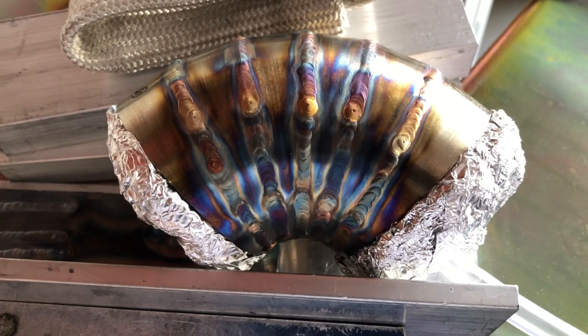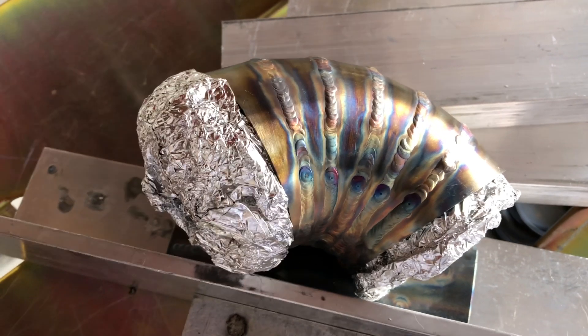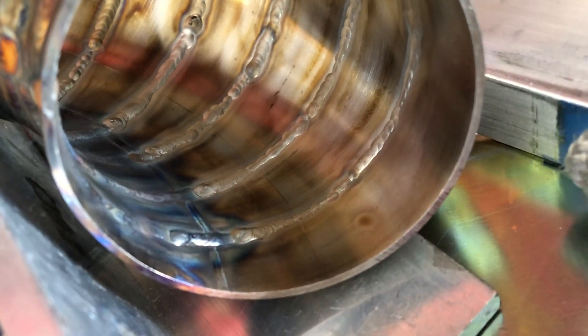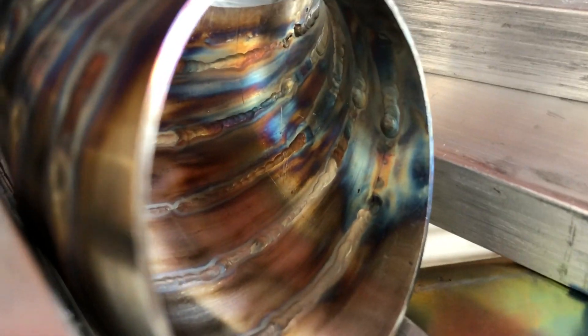I just finished welding all of this up and it's still really hot to the touch. I'm pretty happy with the results. Being my very first time welding stainless steel, I know there are things I could have done better. On the inside you can see there is quite a bit of penetration going throughout, and there isn't any sugaring because I was back purging while welding the whole time. Some spots need just a little more — I probably need to go over them to get that penetration going throughout.